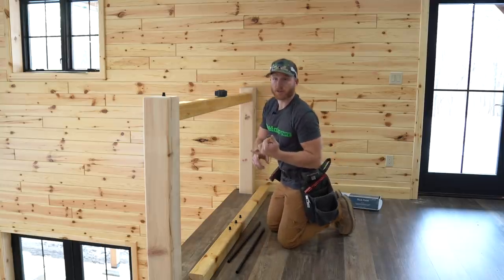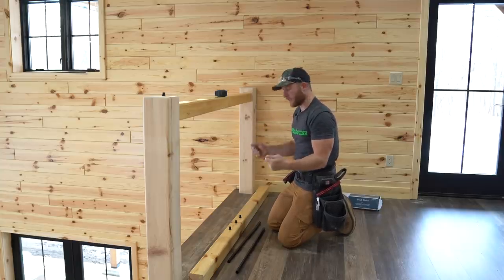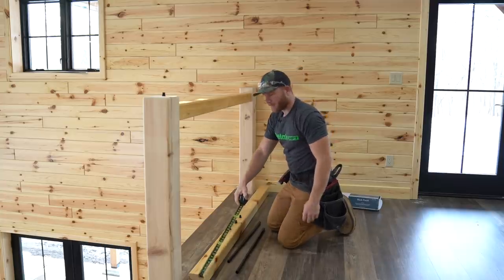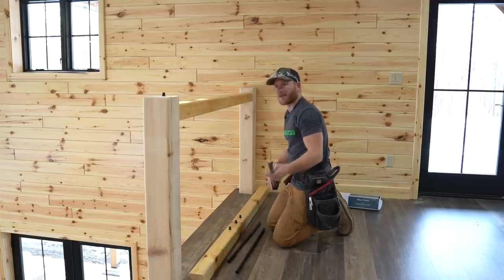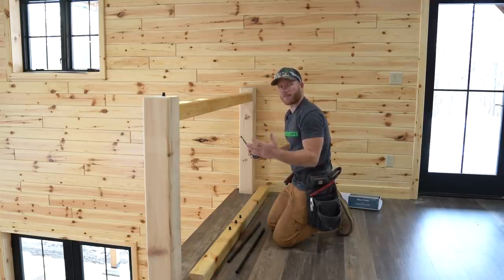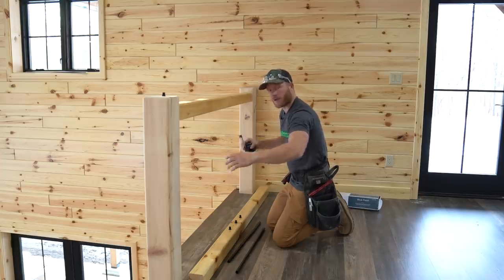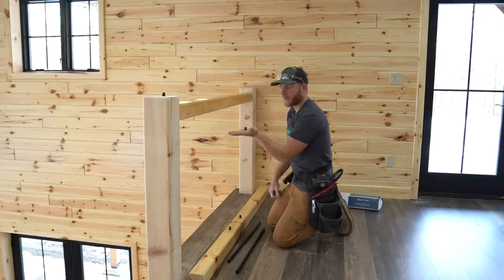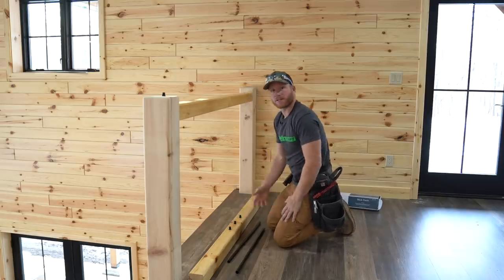And most importantly, I've got 7 of these rail sets to make. I wanna be efficient. So instead of every one of them coming through and measuring out all my locations, marking them, trying to get them all straight, I'm gonna go ahead and make myself a quick template out of plywood that I can put on each top and bottom rail with a hole already drilled out, so I can just set the little plug right in the hole and fasten it right where it belongs. That's my thought anyway, so let's go ahead and do that and see how it goes.